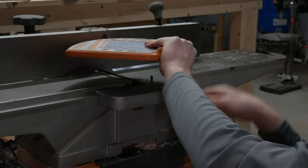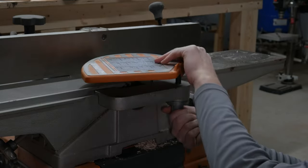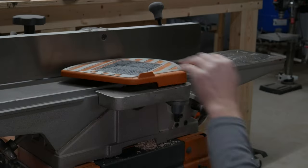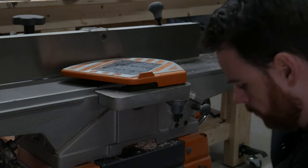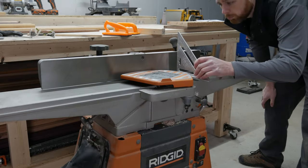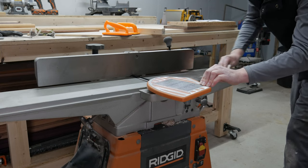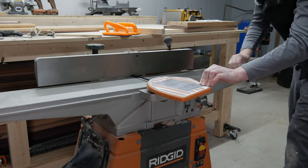Unplug the jointer one more time and place the guard slightly in its slot. Before setting it down all the way, rotate this dial to load up the internal spring. Slide the guard all the way down into the clip and fasten with the screw. This part isn't necessary, however, since we are down here, we can check the fence for alignment and apply a fresh coat of wax to the jointer table.